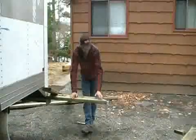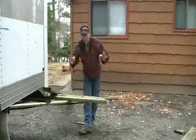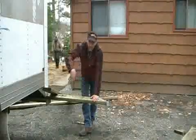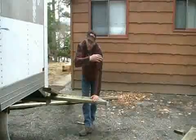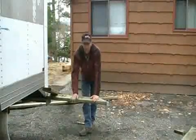Tighten these lag bolts up, do the other end, make two sides, lay those into the saddle brackets attached to your dock, put your crossers in, then your top deck boards, screw them all down, push it out into the water, connect it to shore, and you're done.